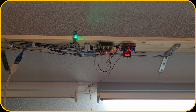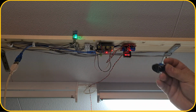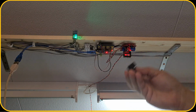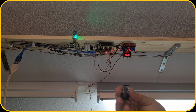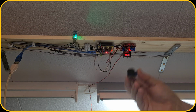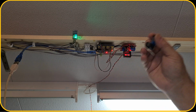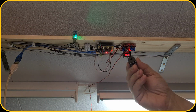One thing which I would like to do, and that is a test here, I would like to test the current flow. As mentioned, I have different current sensors which I'm using on the main track, but actually I would like to test this one. And since I now have this test track, I will be inserting this one, connecting it to the Arduino on the analog ports, and see what comes out. Maybe I can use these to check the trains better, because every train has its different current. So that is what I'm gonna do now. I'm gonna install it underneath here and reconnect it to the Arduino, and I will show you that what the outcome is of the transformer to detect current on the track.